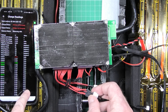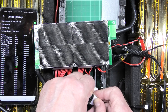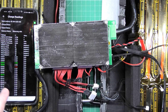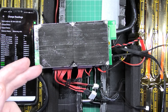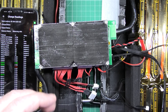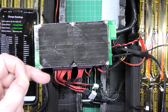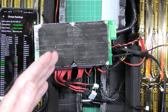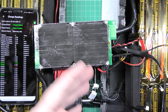So the problem - there you go - and I'll put it back in and it all goes back to normal. Wait for this alarm to stop. What was happening was in the last video - cell number ten was becoming disconnected off the BMS, so cell number nine's voltage was completely dropping off and cell number ten was going over-volt.